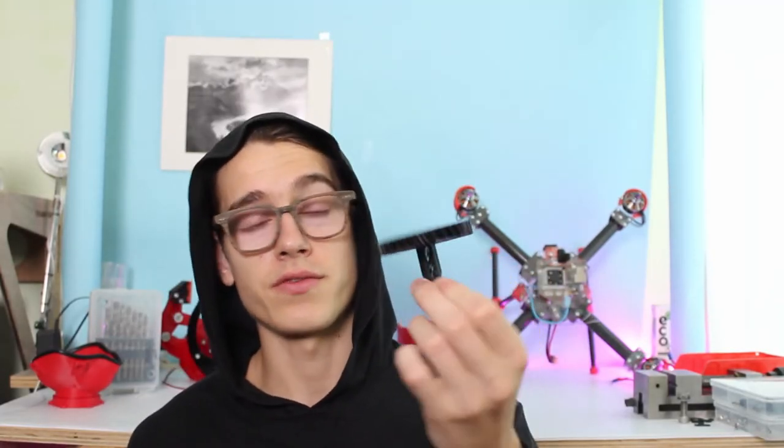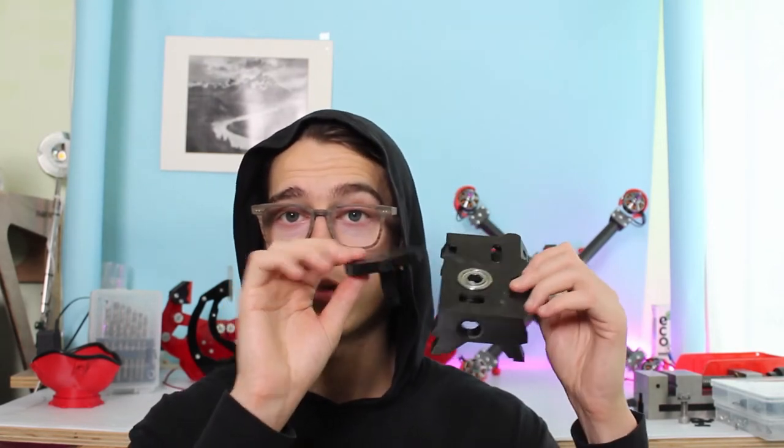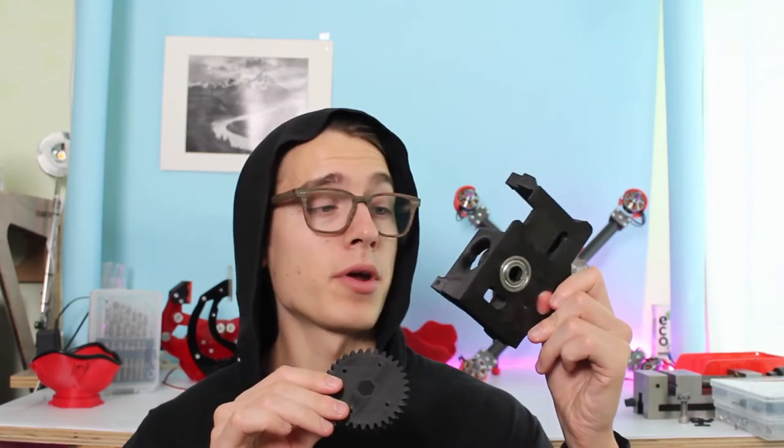Culprit is this gear right here. Now this gear has a very skinny axle, and for the size of the camera, which is as big as my head, it's a little too skinny, too weak, it's not that stable. The axle wobbles inside the gear, and it also wobbles inside the body of the slider, inside this bearing right here. So I'm gonna go ahead and redesign this to fit a bigger bearing for a bigger axle, and also redesign this to have a bigger axle.